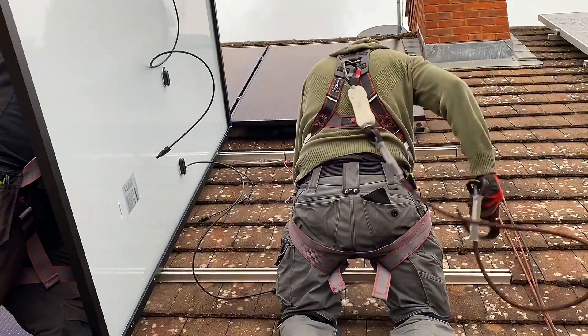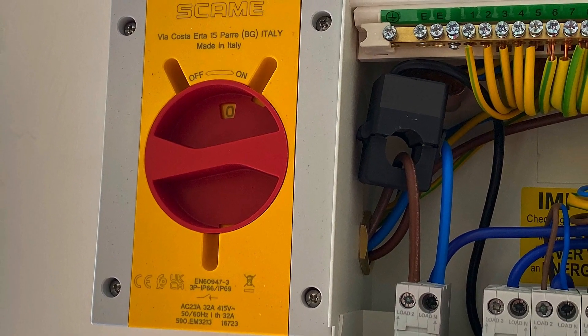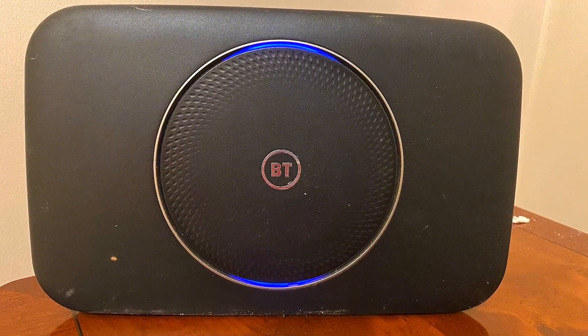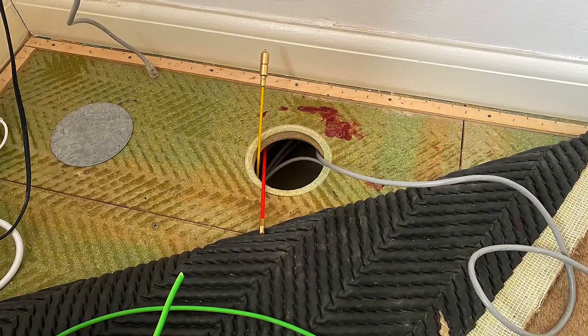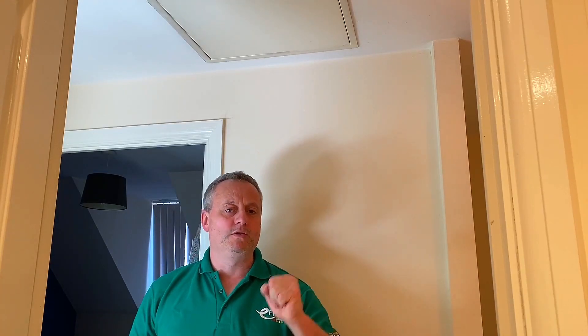Find out which unusual room in the house I had it installed in. I wanted to make Sean, Scanland, and Paul's life a lot easier, so before they came I actually pre-wired the installation with my great mate Marcus. We took from the consumer unit a 6mm² twin and CPC cable, two green-and-yellow 6mm² conductors, as well as a Cat6 cable for my CT clamps. My router is just down here, so I also ran a Cat6 cable there for internet — the SunSynk works on Wi-Fi, but I pulled it in anyway just in case I'd need a hardwired connection in future.